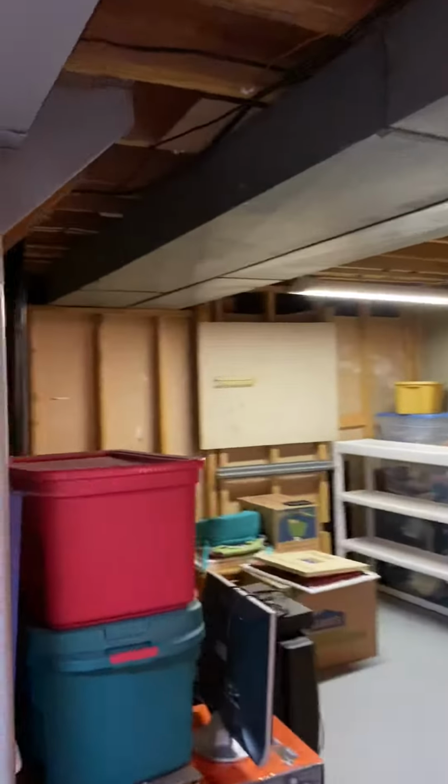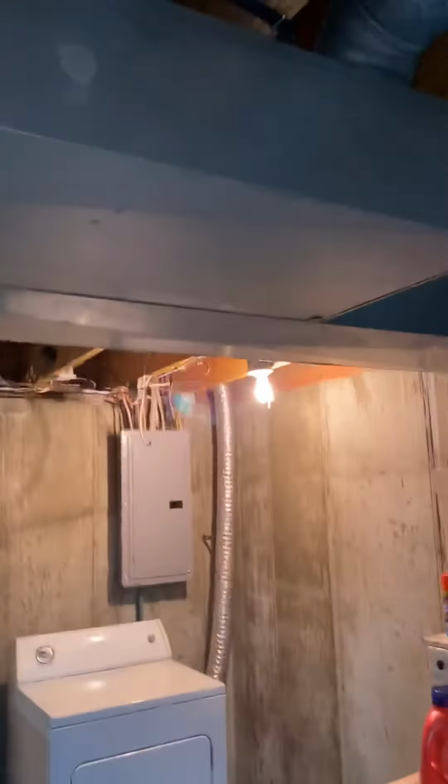One thing to note, let me walk through here. There's no returns. I'm taking a video, so don't mind me. There's no returns in the basement. And I'd like to grab a light. Right out here. Got it, thank you. There's no returns in the basement at all, and this is all exposed, so I'd like to go ahead and cut in a return. I've got my tape measure on me.